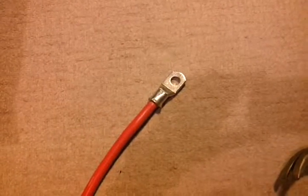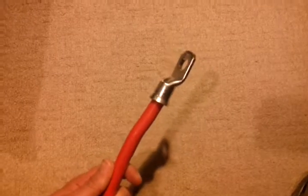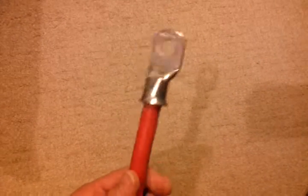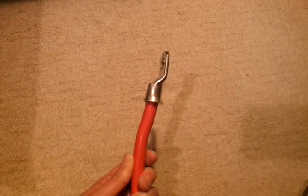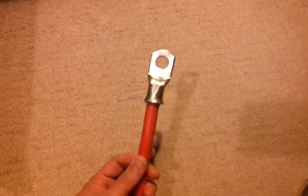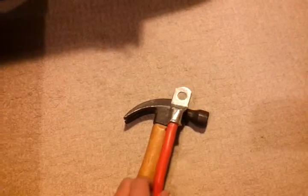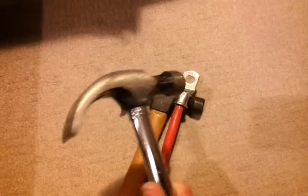Now that the batteries are almost full it's time to make the cable lug connection. It's 35 millimeter square cable and this is an M14 120 millimeter square cable. I've had to bend the end of the cable over double and then it will fit in there quite well, but I haven't got the very expensive crimping tool used to crimp it, so I'm just going to bodge it. You can do this with just a couple of claw hammers - use the curved parts here and then you sit the fella in there like that and just hit it hard with a big hammer and that will crimp the ends down.